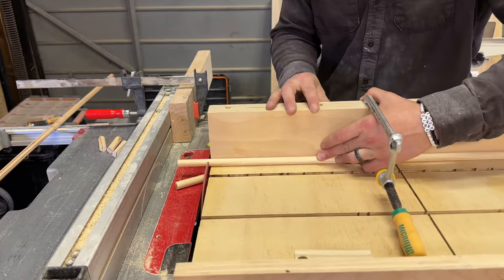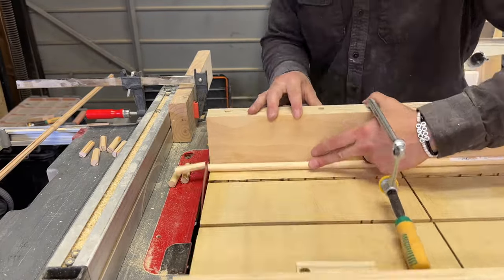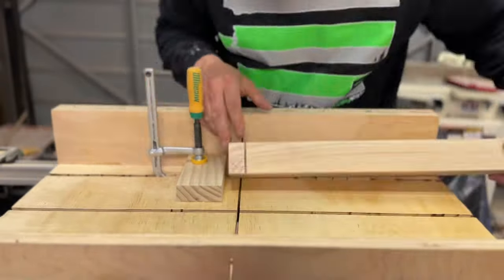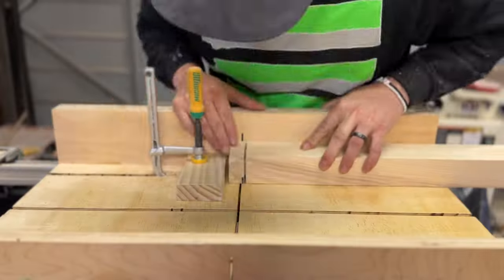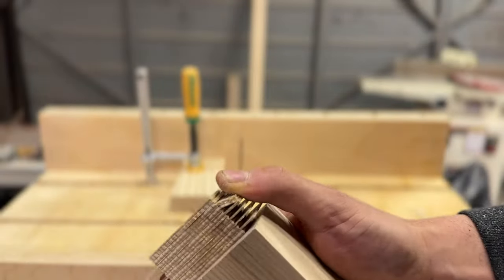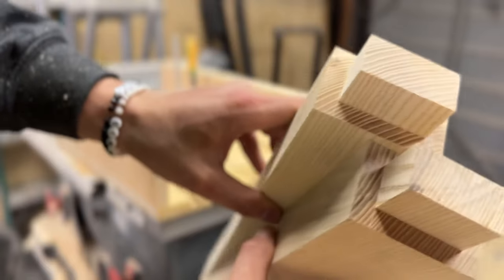You can also use your sled to cut small pieces like dowels without having parts bind up between your blade and the fence or your stop block. My favorite technique is to create perfect tenons by setting up a stop block and limiting the blade depth while creating a bunch of repeat cuts. After breaking off all the little pieces, I skim the part right back over the blade, creating perfect tenons.